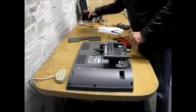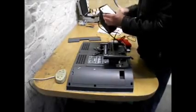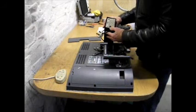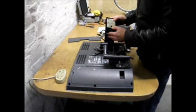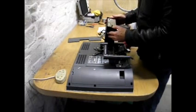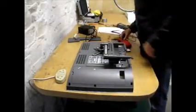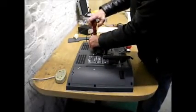I have here a transformer regulator power supply. This is 220-240 volt input. The output is 13.8 volts DC, with 4 amps continuous and 6 amps peak. So it will be just over 1.2 volts under-rating for this television.